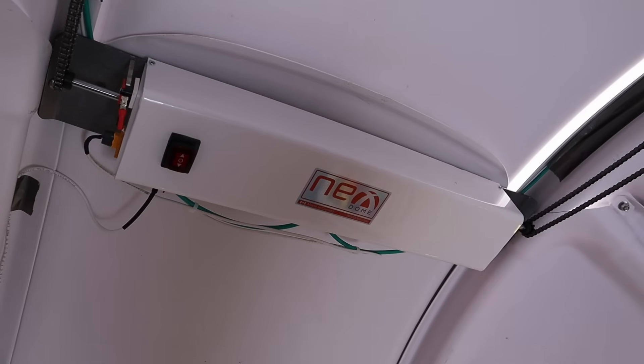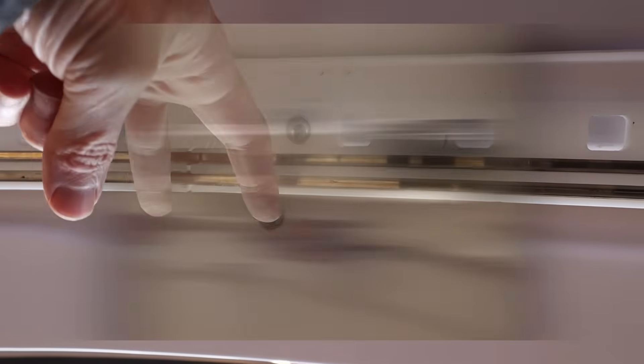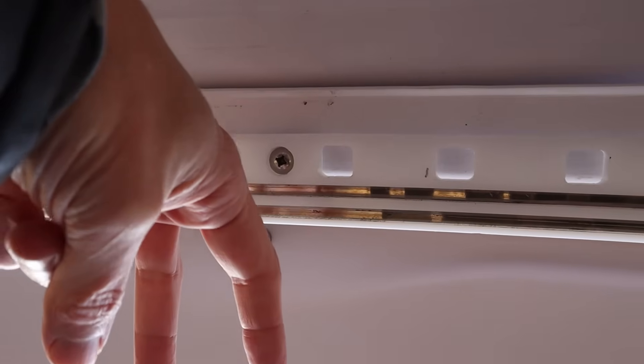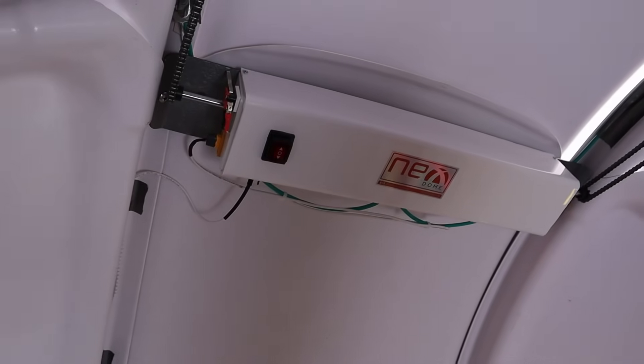Come to find out, this shutter automation assembly is a new design from a year and a half to two years ago. Prior to that, the shutter system would ride on the front of the shutter, mounted directly onto it with two magnets hanging down and a charging assembly below. Those magnets would connect as the shutter came down, hit the charger, and charge the battery in that shutter assembly. When you opened the shutter, that magnetic connection would break and the whole assembly would ride with the shutter until it reached its up position.